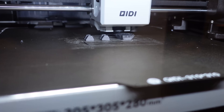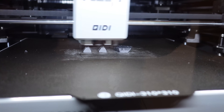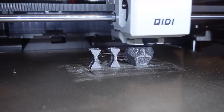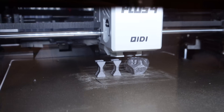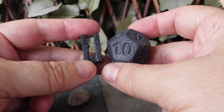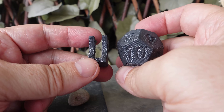I am having this D12 dice next to it, just to have more time for the layer to cool down, but also I want to see if those overhangs will be printed too. Test objects are almost finished — I will check those overhangs later when I take them out. There is some stringing, but I don't care about it. Maybe I should dry the filament because it was in the open air maybe five days.